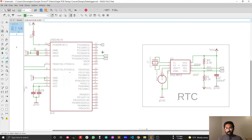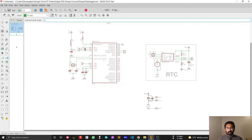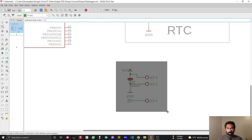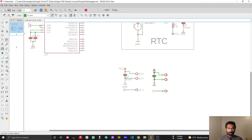I've connected one analog signal with my ADC pin 0. Now I need to copy this and connect the remaining three analog sensors. Let's use the group tool to group all components together, then select the copy tool, right-click on any component in the group, and select 'Copy Group.' I'm copying the whole group — I need three more of the same. Since I've already copied the group, I can now use the paste tool.